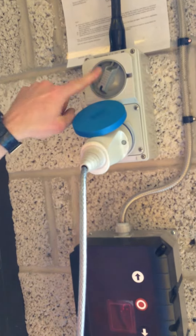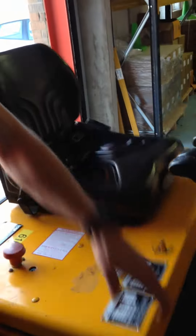The plug will not come in and out without the power being off. Back to the forklift, plug him back into her. Tuck the wires away so they don't get trapped by the seat. Little pressure here and release the catch. The forklift is ready to go.